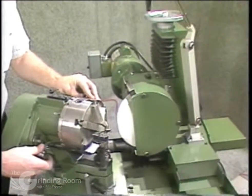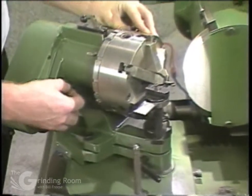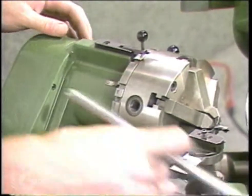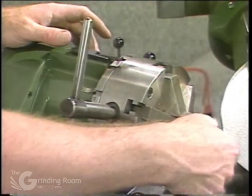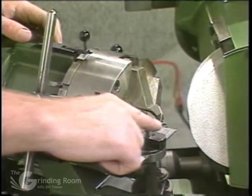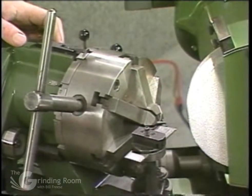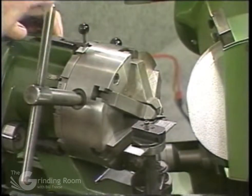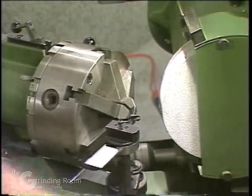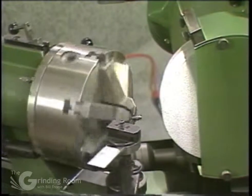This segment covers grinding a left-hand drill. Grinding a left-hand drill is pretty much the same as grinding a right-hand drill. The main difference is you use a different cam — in this case, you use a number one cam for a two-flute twist drill. Push the head forward, slip the cam on, and instead of putting it in the right-hand slot, you'll put it in the left-hand slot. Setting the drill up is pretty much the same too — you're going to go out by sixteenths of an inch of drill diameter, but you're going to be rotating the lip up to the setting blade instead of down. The cutting edge will be level with the step, coming from below. Tighten it, pull it back, and instead of cranking clockwise like you do for the right-hand drill, you're going to crank counterclockwise.